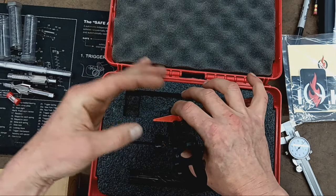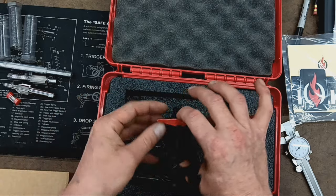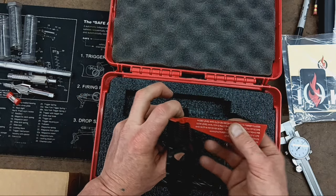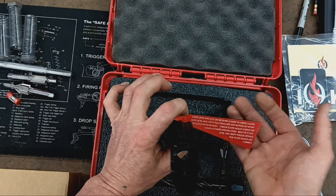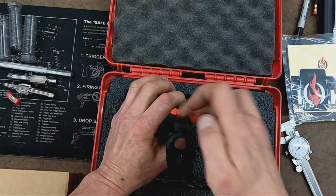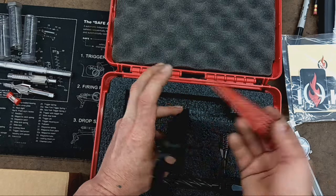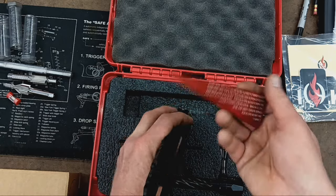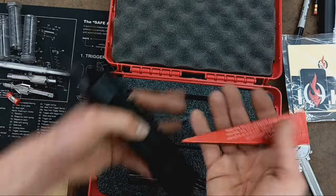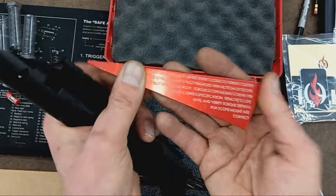Right, so you'll get your scope mounted up, and almost every scope on the planet has a flat on the bottom. So the idea here is to essentially force your scope level with the receiver. Kind of a different way of doing it. I would use this personally as a rough start and then do it traditionally with an actual level on different surfaces and things like that. But yeah, that's kind of cool.